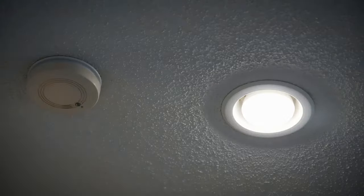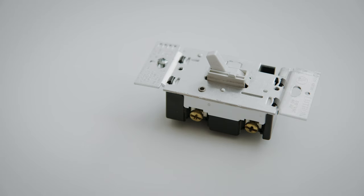Unfortunately, when I turned on the light I immediately noticed a lot of flickering. Something was wrong. I discovered that it was simply because my old dimmable light switch was not made for dimmable LED bulbs.